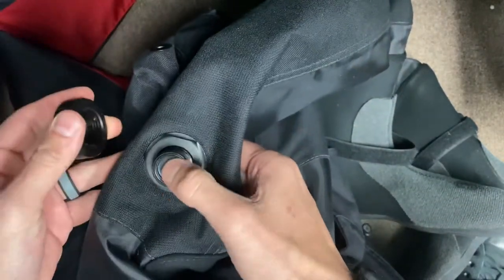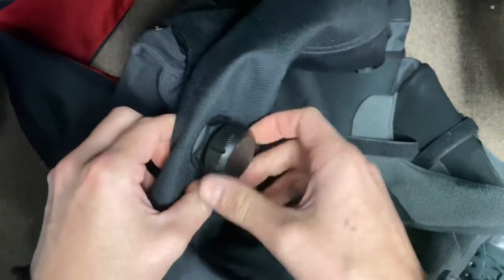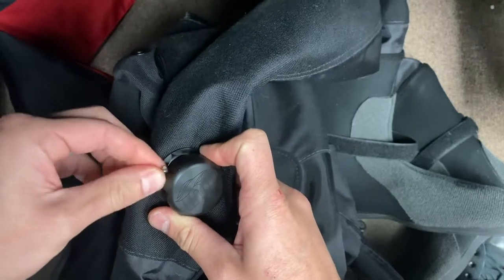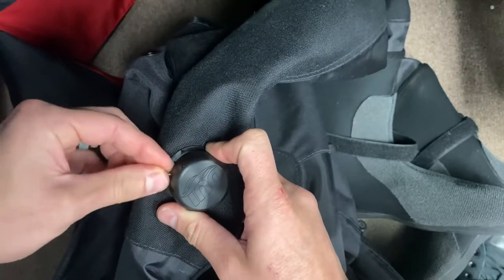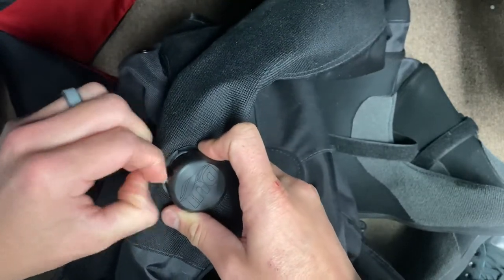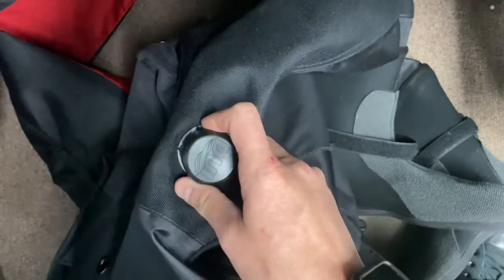Maintenance on these — you're dealing with a soft silicone-like material. Not a bad idea to spray it down with a little bit of silicone spray every once in a while. Definitely want to be doing a good fresh water rinse with your P-valve system. A cleaning mixture we use here is just water, alcohol, and vinegar down the P-valve hose when it's open. Then take a little bit of compressed air and just dry it all out — that works real nice. Everybody's got their own method, but probably the only thing I would stay away from is anything real corrosive. Steramine's another one that, if you've got it, works real great — keep a big tub of it.